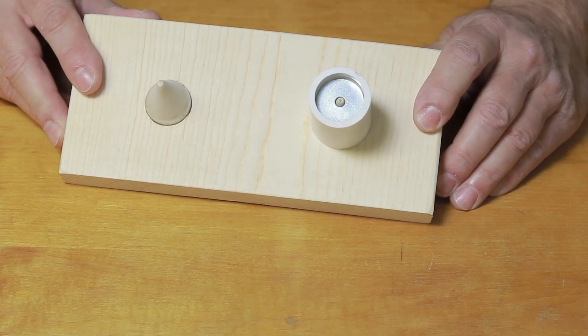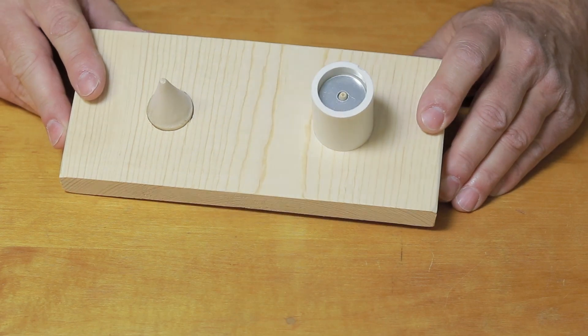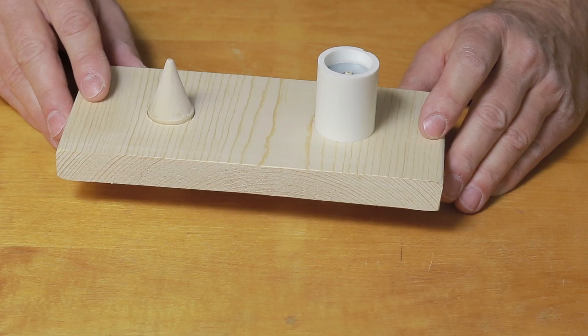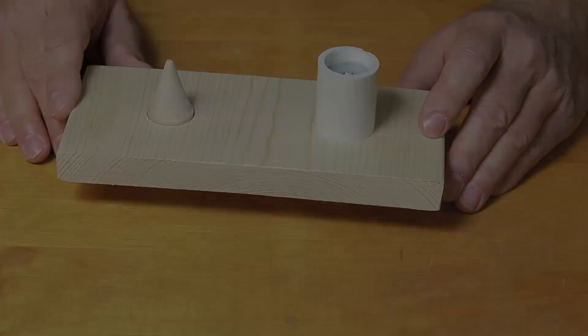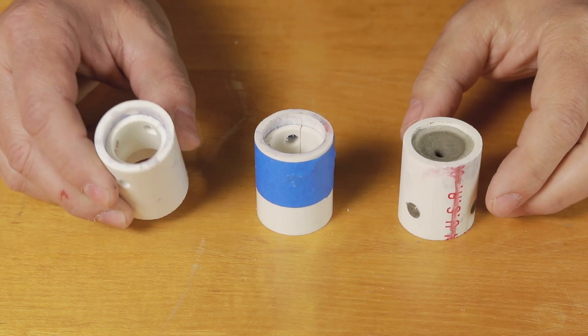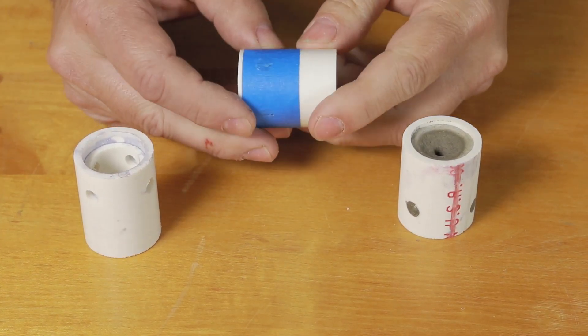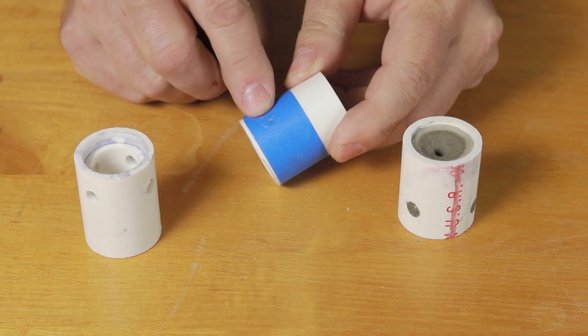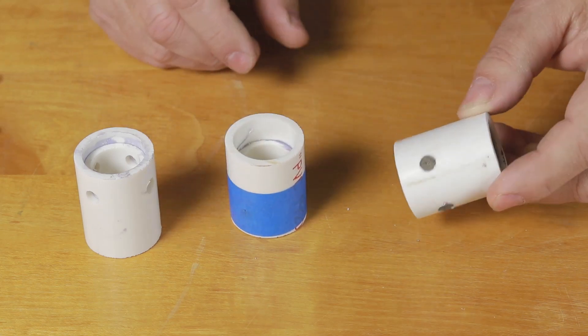What we would like is both of them to fit about the same. Once we're happy with the fit, we can just glue the pins in, or in this case, a minor press fit. After that's all done, we are ready to go for the next step. I've glued my insert in and drilled the holes. After that, I put tape on the outside, and where each hole is I put a small slit. That allows air to escape and the concrete pins will form properly like this.